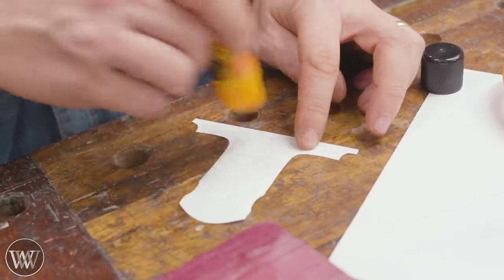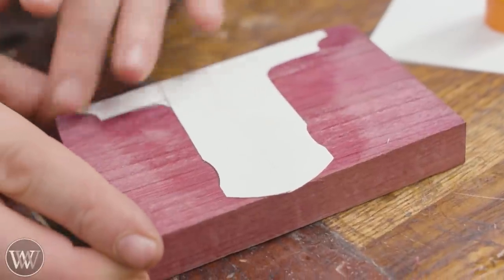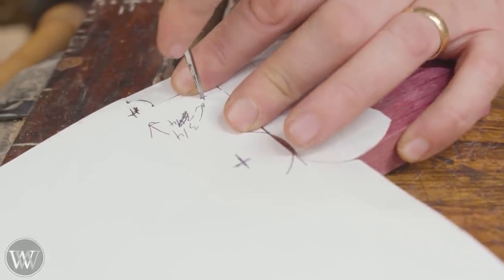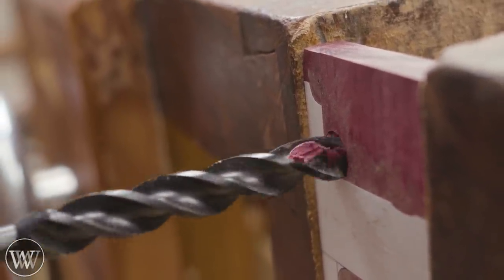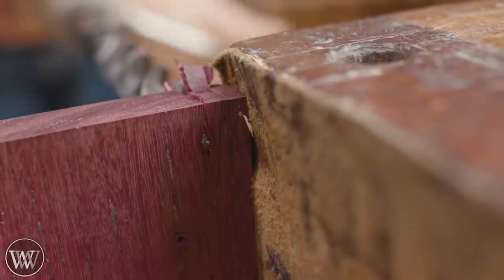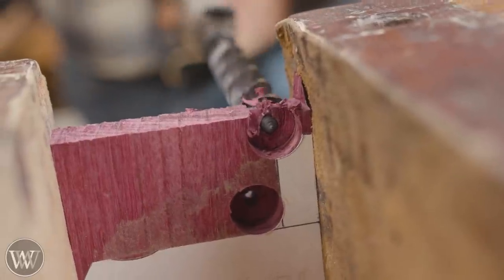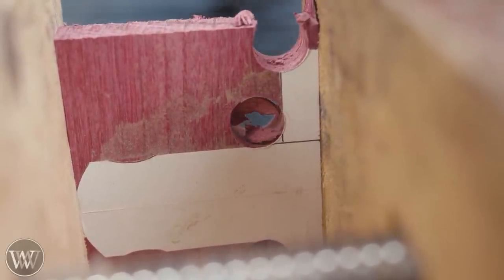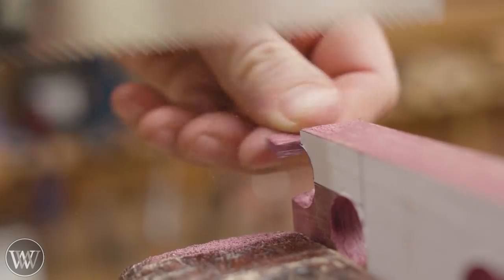I'm going to use a little bit of a glue stick and attach the pattern on there and then cut out around this. The glue stick is one of my favorite ways of putting a pattern on because you can scrape it off and clean it off relatively easily, but it will not come off accidentally — it's a very solid connection. I have several locations where I'm going to be drilling circular holes to get the rough shape, and I have the converse of the pattern to know exactly where to put the auger points. We're going to clamp this in the vise — you can see how it's starting to split here, but that's okay because I'm going to be removing that material anyway.